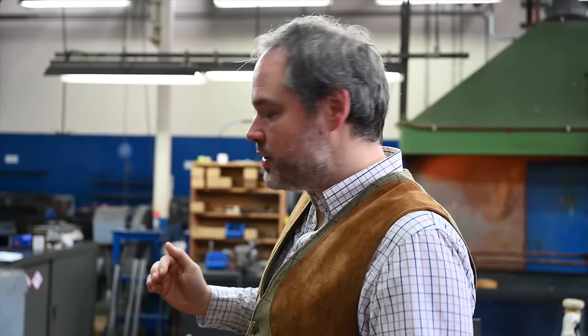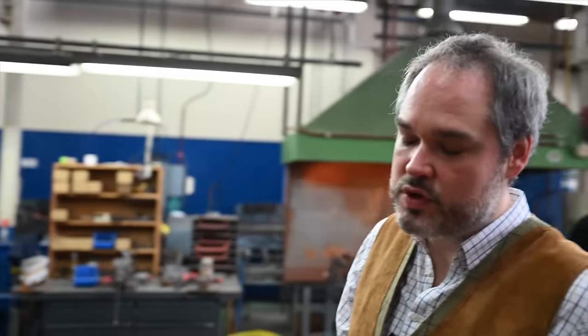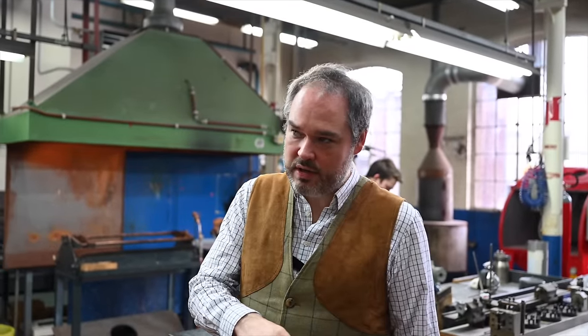Basically, the two tubes are assembled together, and we use silver for the tubes and tin for the ribs. Because the fusion temperature of the tin is lower than the silver, if one rib is damaged, for example, we can disassemble the ribs without taking the risk of changing any convergency or moving the tubes of the barrels.